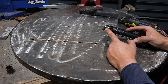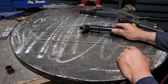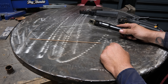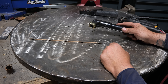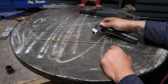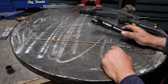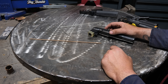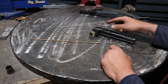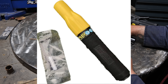With this design, if you don't have a rod in it and you set it down, it will not arc out — it's almost impossible to arc out this stinger onto something. Likewise, if your hands are sopping wet and you grab this, the odds of getting shocked are about zero. These are inherently fairly safe. I've been told — and I don't know if it's true — that overseas there are regulations where this style is required.